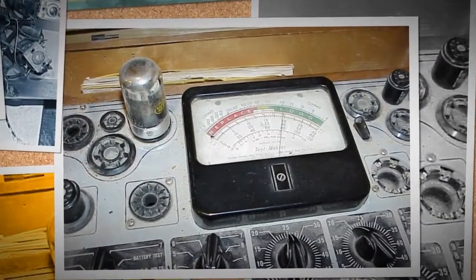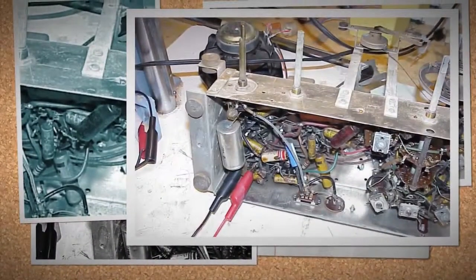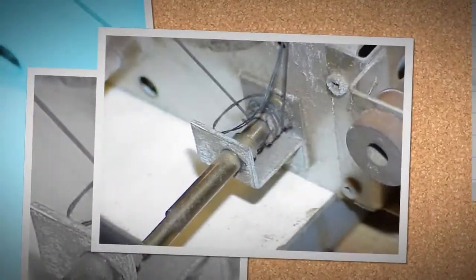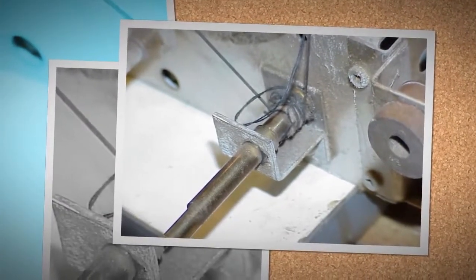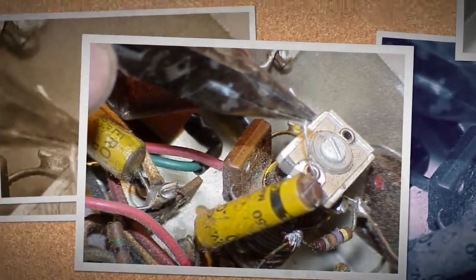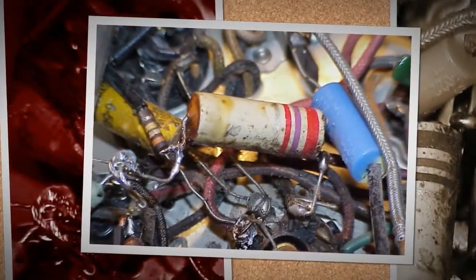The stain is very red, but when rubbed and then rubbed away, it blends quite well with the walnut veneer and the radio will have an attractive reddish patina. A little medium walnut trim coat by brush to bring out the base trim contrast and it is ready for finish polyurethane. The stain needs to set up overnight.